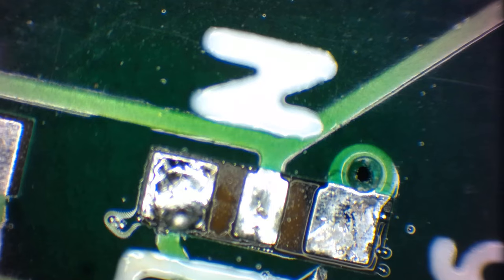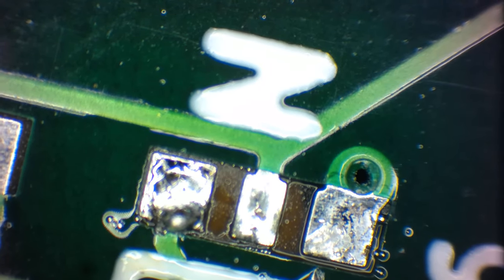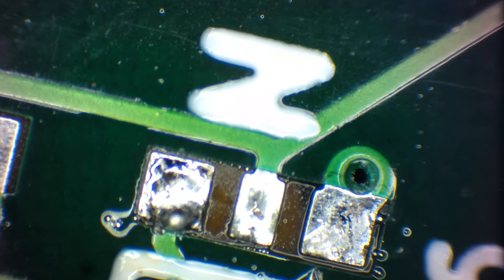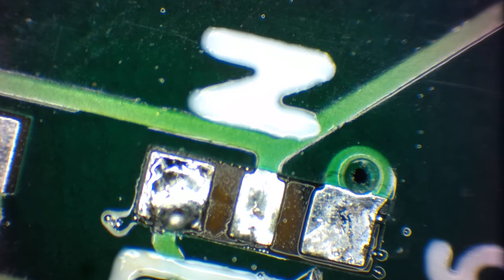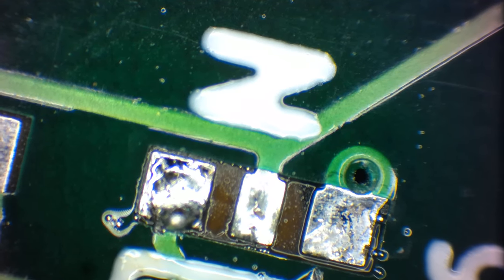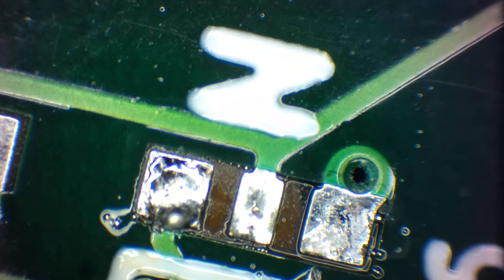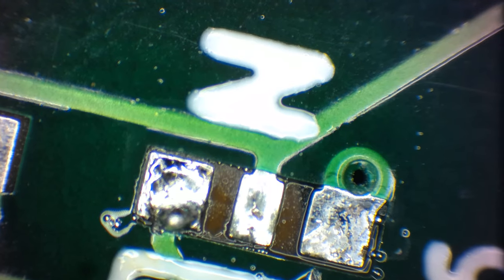You can see that you can actually solder using solder paste, but under magnification I really don't recommend it. I have this huge syringe of soldering paste and I basically barely touched it to the printed circuit board and ended up with all that soldering paste. It's much better to use a soldering stencil — I typically use a stainless steel stencil.